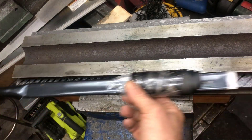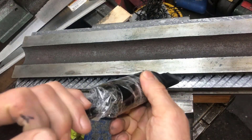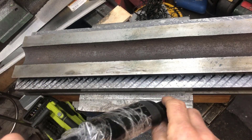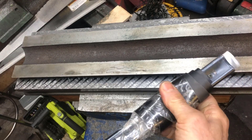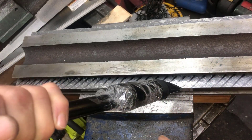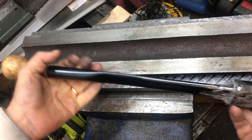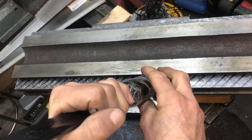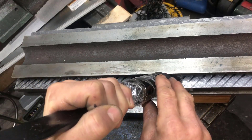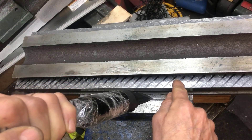I'm using a modified Anderson scraper, using it for the upwards motion bumping and to protect my hands a little bit. The marks here are more inconsistent than with the Biax Half Moon Flaker, as to be expected — all much more dependent on my skills. I've learned that I should hold this at a specific angle, and with this length and the stroke arm, I hold a little bit above and lean forward, also angling it a bit. This determines how the marks will look — whether I get a full curve or just some flat marks.